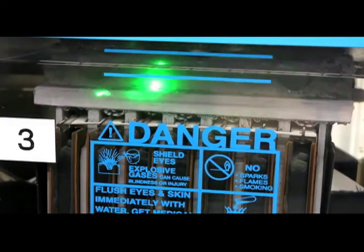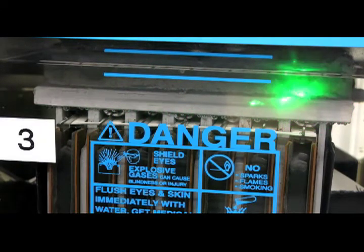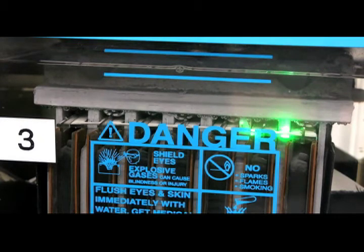This is a close-up of the negative strap of a cell. We can see that the plates connect to the negative strap via the plate lug, which extends into the strap and is connected using a lead burn, in which a torch and a lead stick are used to connect the strap to the plate lugs — very similar to a soldering operation. The positive plates are similarly connected to the positive strap via their plate lugs by a lead burn.